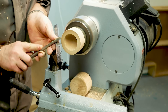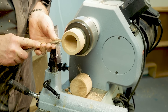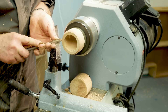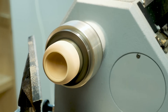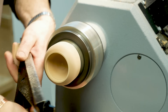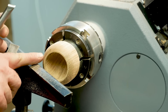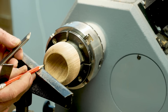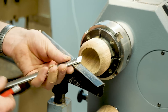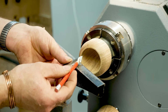I'm going to round the corner off using the bowl gouge — gently roll this over to really create our profile shape a bit more and give us more access when we've done the lid. We've fitted onto the base. The last place we need to clean up is the little flat section with the bowl gouge cut. Now back to the skew — we can use this to do a sheer scrape action. With our burr on the top edge that we produced, it will give us a nice fine cut.